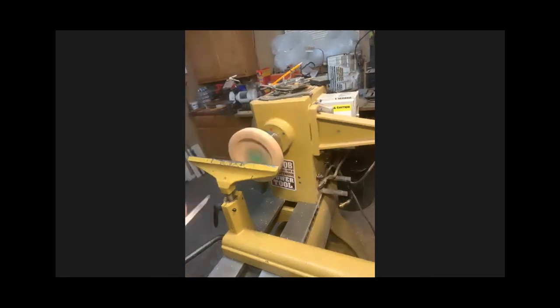It's just intimidating to do. Oh, that works. Yeah. For new turners, the comment about the set screw was, if you do what Doug did a minute ago and turn on the flip side, if you get a catch, you will have a tendency to unscrew your piece and chuck off the lathe. That's why the set screw is in there as a safety precaution. And even if you don't get a catch and you're just turning a really big piece and you go to turn your lathe off, sometimes the weight of it will just turn it right off on you too.